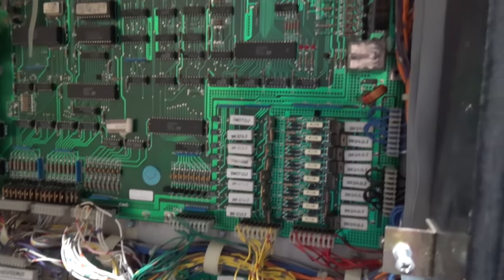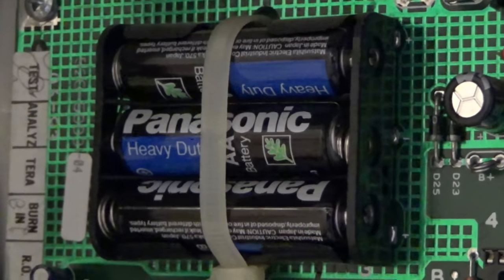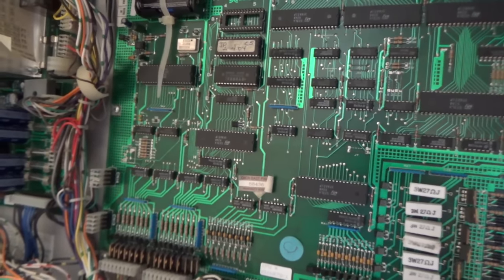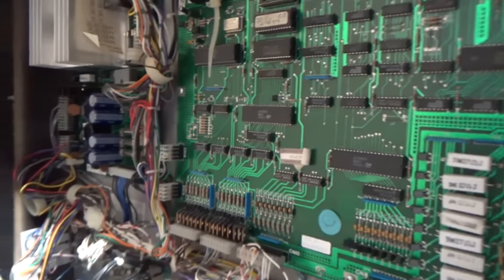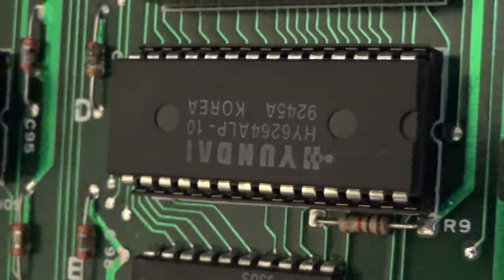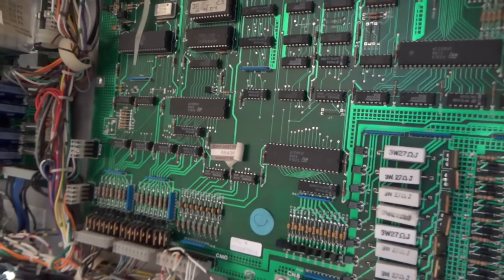And then the main board, and the batteries. No problems yet. Doesn't look like. But we're gonna get those out of there. I think what I'll do is I'll test those batteries. What do you think? Let's see what they measure out at the moment. And then we may be able to put an NVRAM solution. Would it go right here? I believe it would. So I think if I take that chip out and put an NVRAM in, that would make it where they never need batteries again. But they'll need an NVRAM chip 40 years from now or something like that.